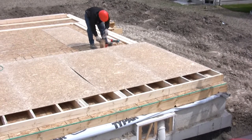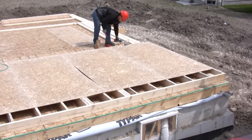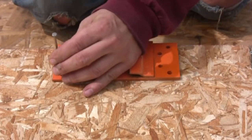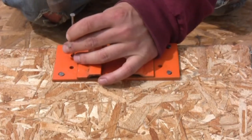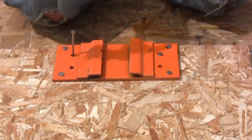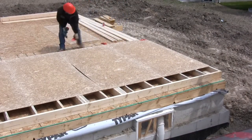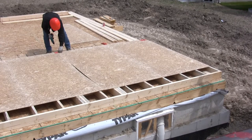The mounting plate for the Exterior Temporary Safety System is affixed to the constructed first floor wall or higher, along the top plate of the wall, using at least six 3-inch bright spiral nails, prior to the wall being erected, based on a 6-inch overlap past post on either side of standard 2x4 x 8-foot dimensional lumber. Be sure that each mounting plate is no more than 84 inches away from another mounting plate, and a mounting plate must be placed at both ends of each wall section.